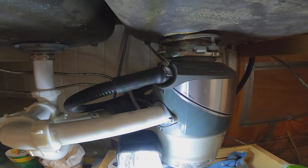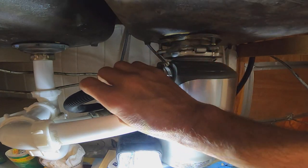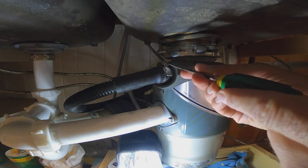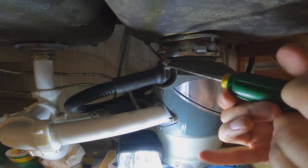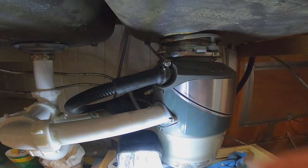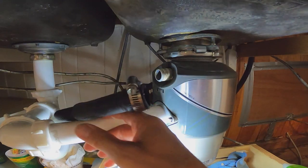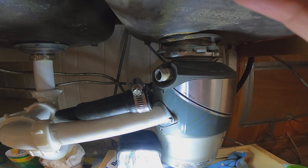The first thing I'm going to do is make sure this is prepped and ready to go. Talking to folks, the drain line is really a weak point on dishwashers. I'm going to replace the drain line. The water line they say is really strong, so I'm not going to replace it. Take your old drain - it's got this little collar right here holding the drain into the garbage disposal, which we will never use again. Garbage disposals are not good. That came off really easily. I'm going to fish it out and our dishwasher will be ready to unpack.